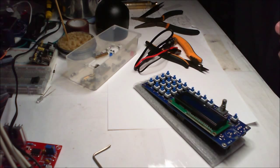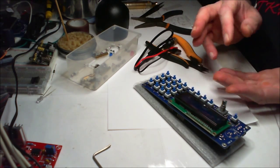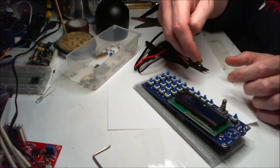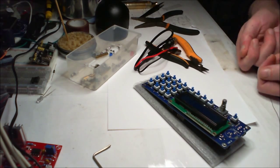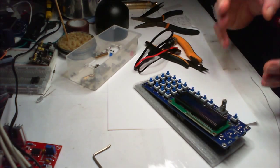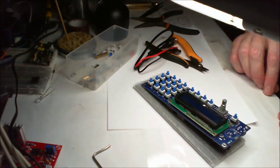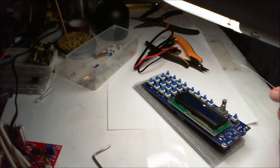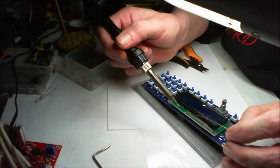It's great. It's got a little job to do for me later on. I've got a little transformer that I want to push an AC signal through and start experimenting with what voltage I can get on the other side of the tiny transformer. A 50 hertz AC signal, 10 volt peak to peak, to see what I get on the other side, and then start turning the frequency higher and higher and see how it adjusts the voltage on the other side. That's a little experiment for me to do, as I haven't done that yet. I know what to expect, but I just haven't done it for myself.